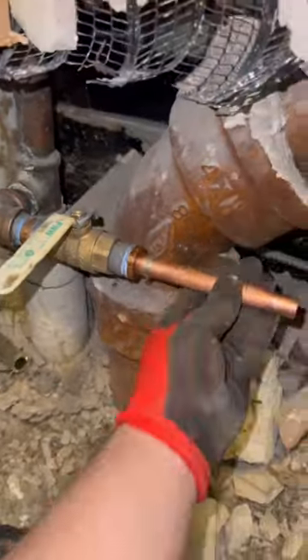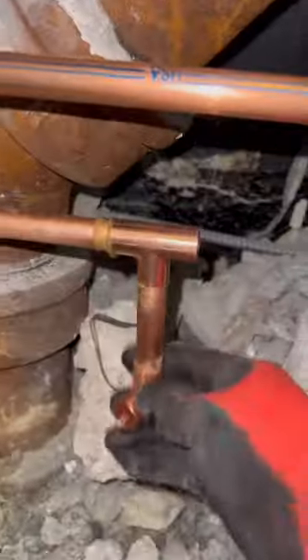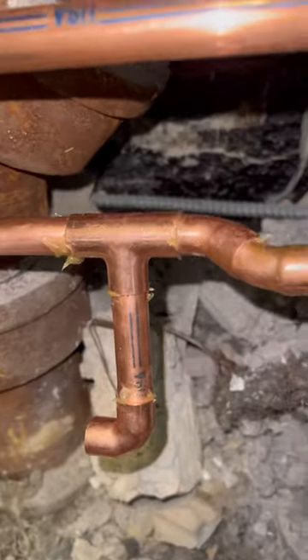After the shutdown comes the plumb down. In this job we're doing the water lines only because the owner wanted to keep the old drains and vents. First we start by wetting the asbestos insulation to try to limit the particles from flying all over the place.